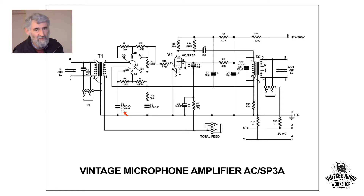Notice that this is a plus-or-minus 2% tolerance capacitor — even nowadays 2% capacitors are expensive, and in those days more so; it would have been individually selected and measured from a batch. There is a little additional compensation in circuit the whole time regardless of the gain. Coming to the valve itself: it is really very unsuitable, but it was what they had at the time. Basically this is an RF amplifier with high current.